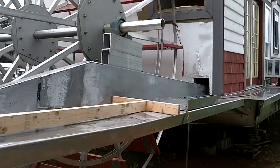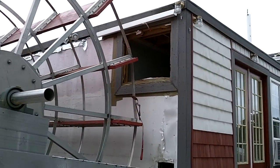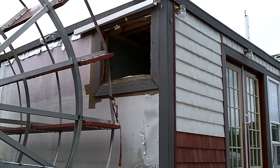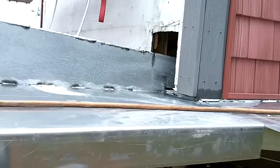I have about a two and a half foot walk-around all the way around it. Here at the top, the big hole — I haven't put a cover on it yet. That's for the split air conditioning system. It's got a two and a half ton system in it. Pulls the air from down below, then pulls the air up, goes through the system, and blows it back out the top, so they have very little return air.